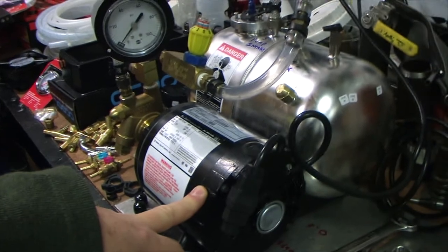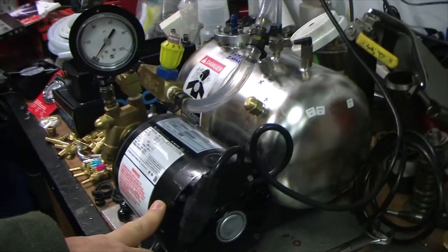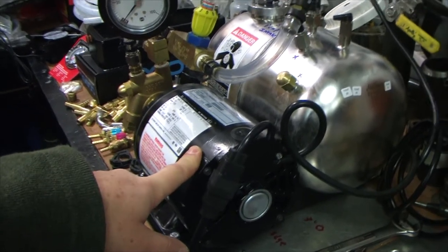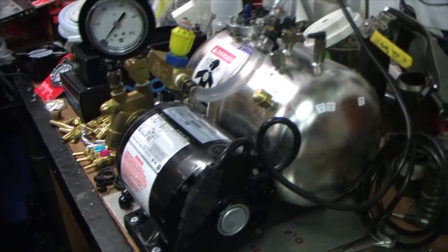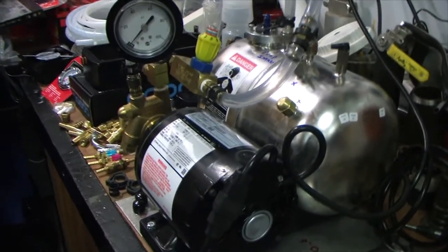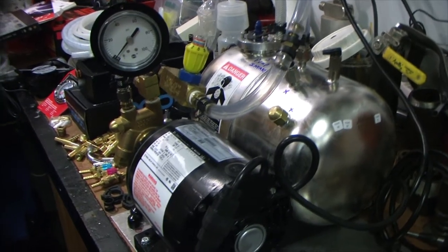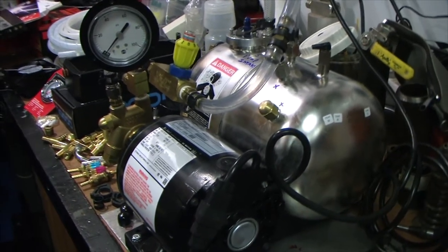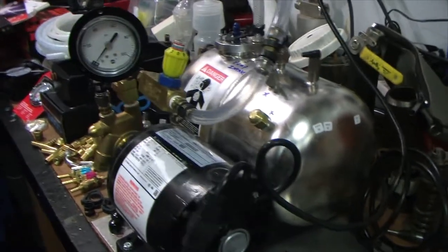Be careful, take your time, find one you like with a good guarantee. This one was brand spanking new, so I was pretty confident I was going to get something good. The pumps do have a finite life — it's been sitting under a counter for five years when the seals went, which is typically the problem. Seals go out and while the pump works, they leak. You can't have this stuff leaking coolant or water in your system, especially while dealing with electricity.